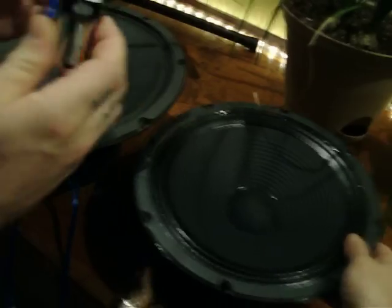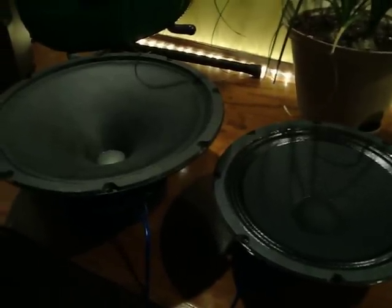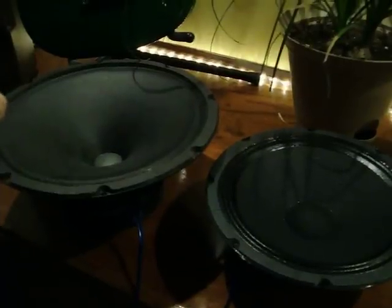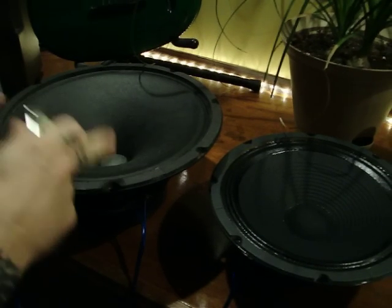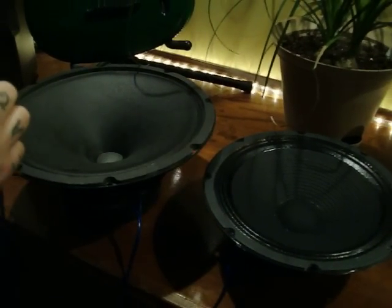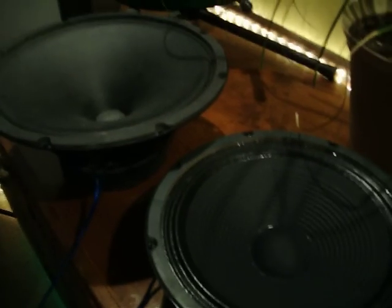We've got the battery, the input jack, and here we go. Both speakers are moving in a negative phase. Flip the polarity of the battery — both speakers are moving in a positive phase, or outward. This is called the X-max, or excursion — the distance the speaker travels in the frame. And that is testing a speaker and speaker phasing in a nutshell.